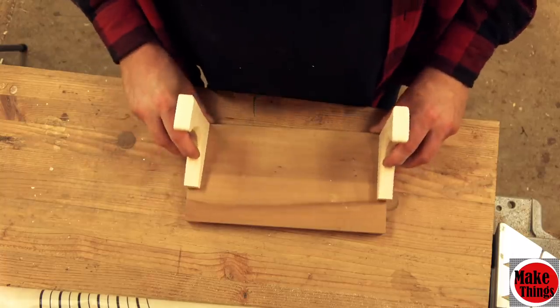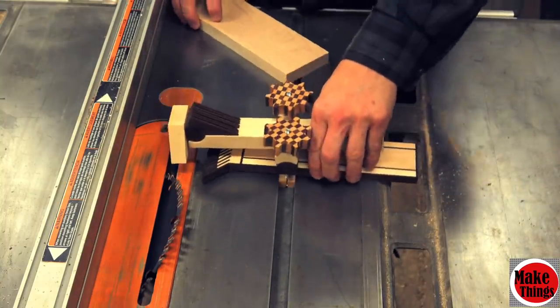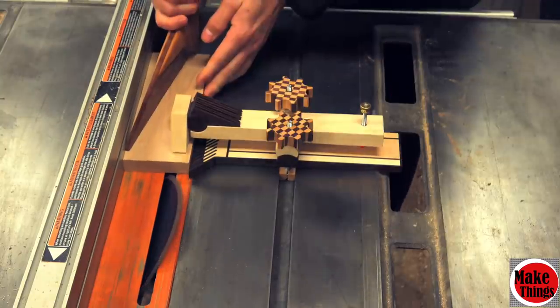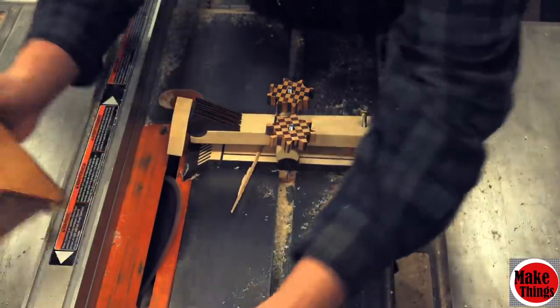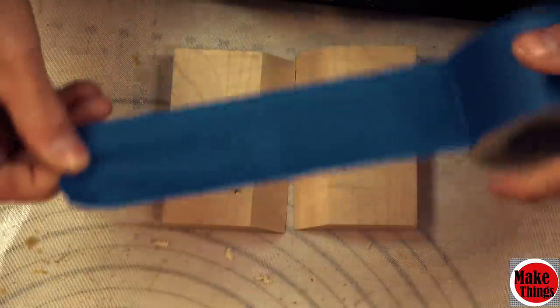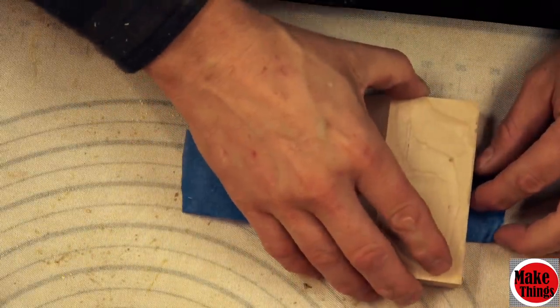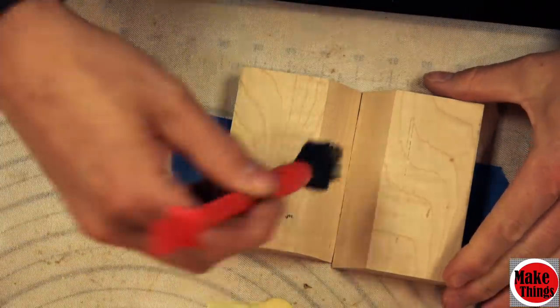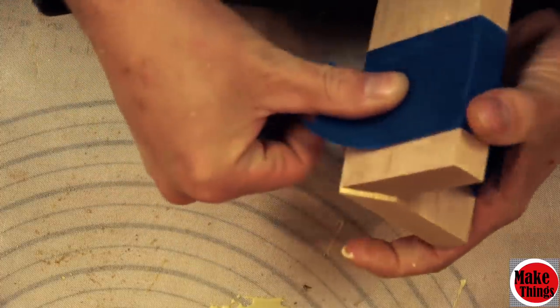For the dowels on our sled we'll now want to make a cradle. I'll admit I'm not the first to grab a feather board for anything I do, but cutting 45-degree angles can cause the wood to lift up on the table due to the increased thickness of the wood. If you'd like to see how I built this feather board, I'll have a link in the description below. After I cut the angle board in half, I use masking tape to glue both sides of the cradle together. This really is an excellent method if you don't own angled miter clamps.